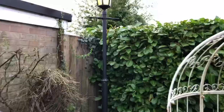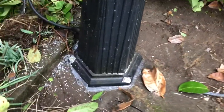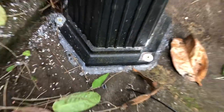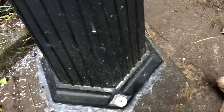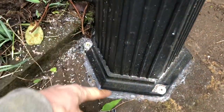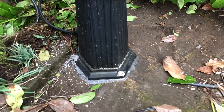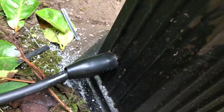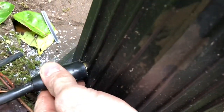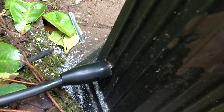Here's this lantern — you can see the silicone I've run on it. I've used outdoor multi-purpose silicone, put a bed of it, and then sat the light onto it to make sure that's all sealed. On this one we've actually run the armoured directly into the aluminium casing. I've cut this one slightly too much so I've run a bit of silicone in there as well just to make sure that's okay — that gives it a really good earth going all the way up.